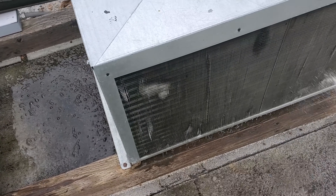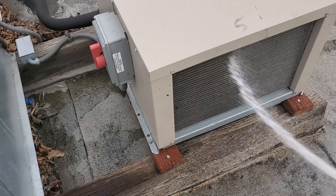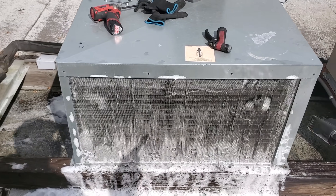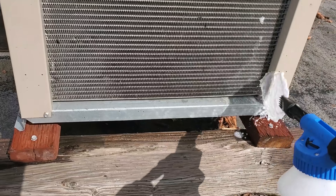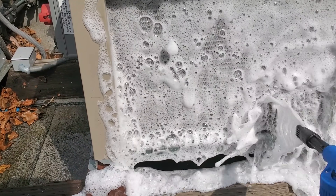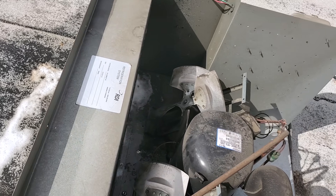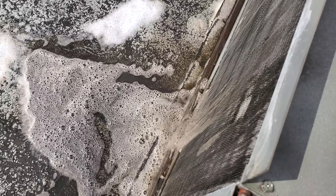The other condensers I'm not going to disassemble — just rinse them because they're working fine. I'll turn the power off and give them a quick once-over. I'm spraying the non-brightener yellow cleaner on these since it's also microchannel-safe. I just got done spraying the main one — this condenser is taking two passes and the rinse is still coming out black. Look at that — it's dirty.